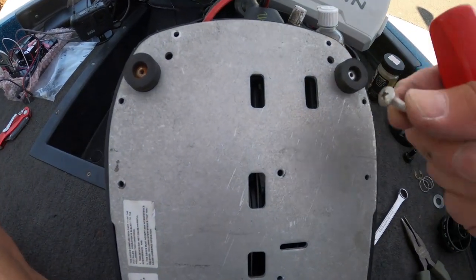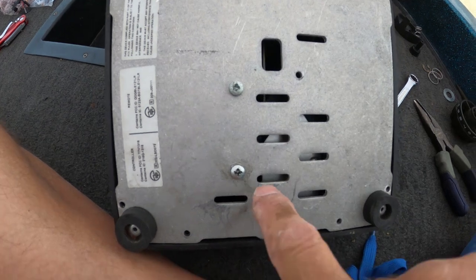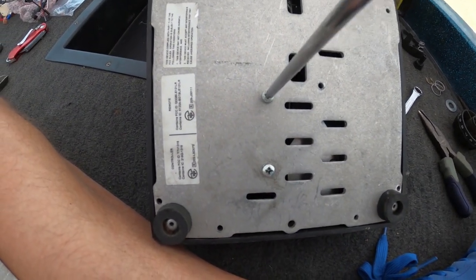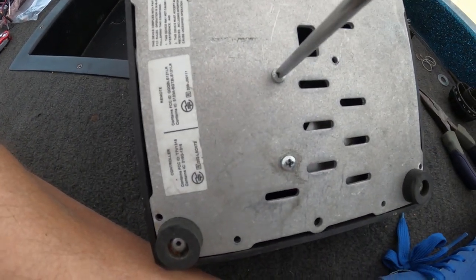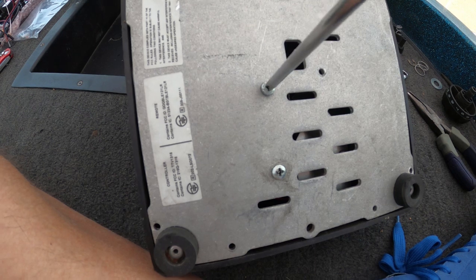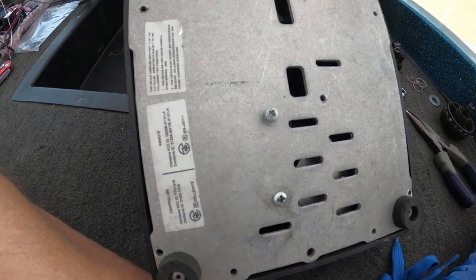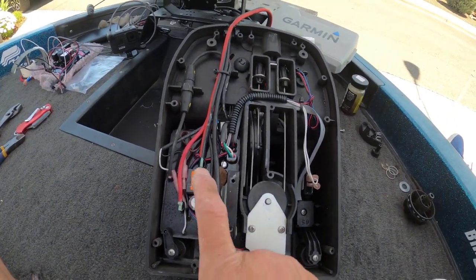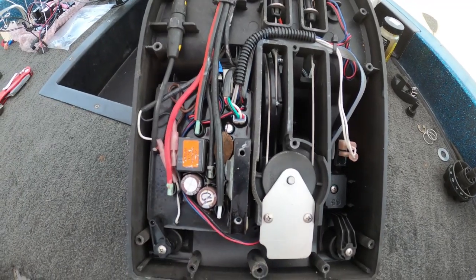While they were leaf blowing, I removed all the screws around here. There are two that are different — these will be discarded because new ones come in the kit. These can be a little stiff so make sure you don't strip them out. These are the ones that actually hold your control board down to that base plate. With the base plate removed, here's our control board — that's what we're going to be replacing.